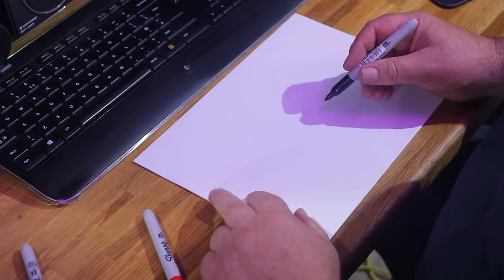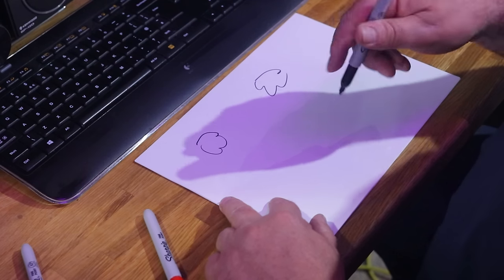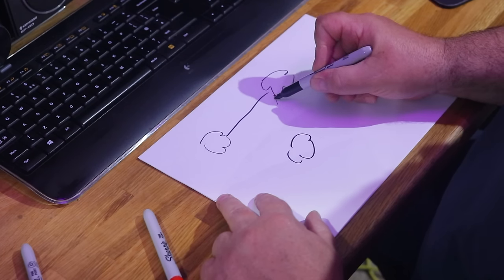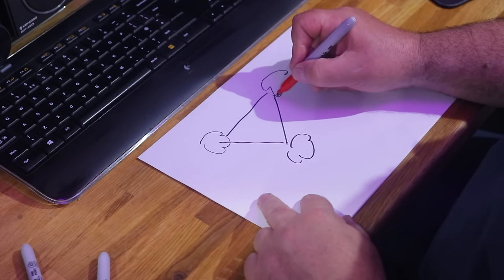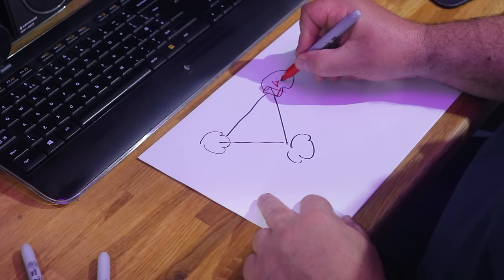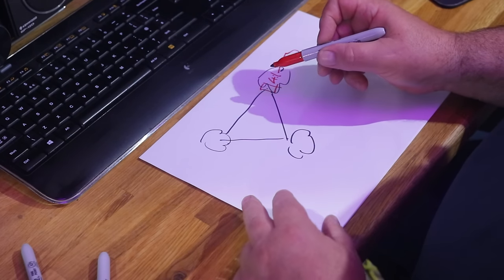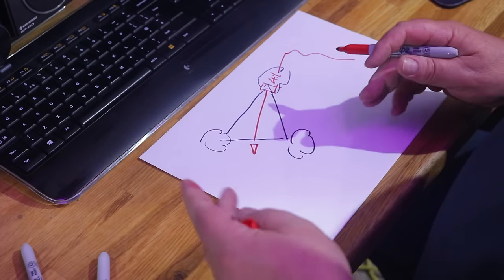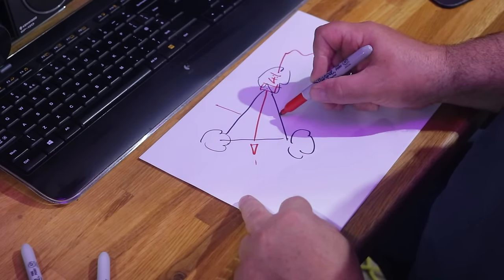So we're looking down at the ground now — imagine flying along in a bumblebee. There are our trees and the ground straight below us. If you had a third tree, you could put a horizontal Delta Loop up in a triangle. I've done that several times — works cracking. I used a 4:1 balun in one corner and ran my coax back to the shack. On the lowest harmonic you get a little bit of gain, and each harmonic up you get more gain.